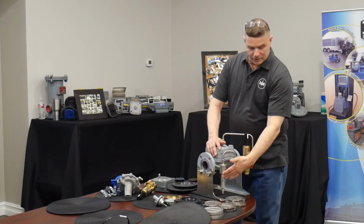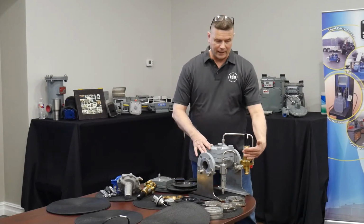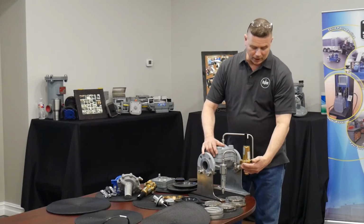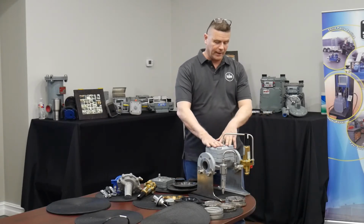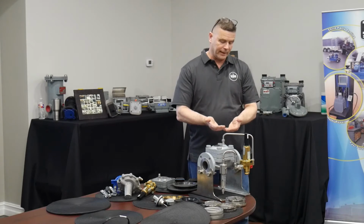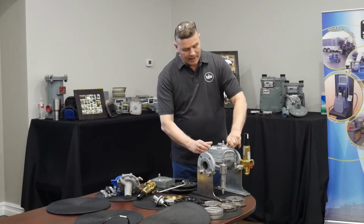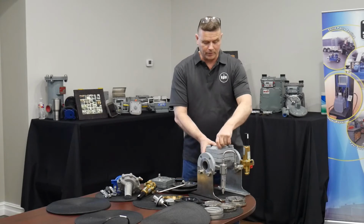So very important to have some filtration, the best filtration. We always recommend a line filter in front of all of this because even though this has got small spaces and is the brain, it can't shut off a body that's got trash in it. So it's always important to filter there as well. Okay. So it has a restrictor, as you know, and we'll talk about the reason for that. And then it has basically gas that passes through this pilot and loads on top of the valve. It is an unloading design. In other words, the pilot has to let the gas come off the top of the spring case or off the top of the diaphragm for the valve to be allowed to open. So the gas pushes up from the inlet side and works its way over. The valve itself is completely bidirectional. So I have these components because I have 2 ports in the body that allow me to put the components in the direction that I'm planning to mount this.